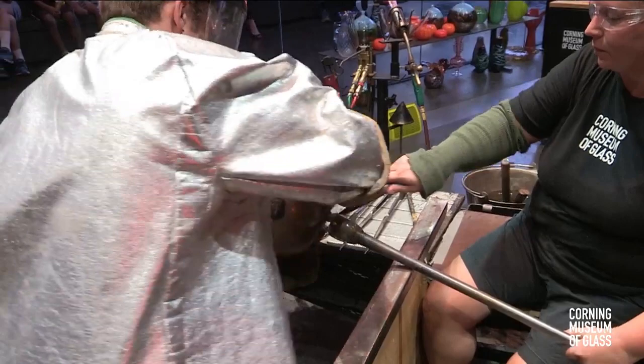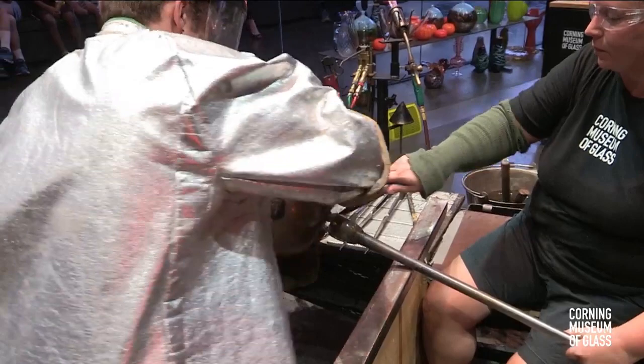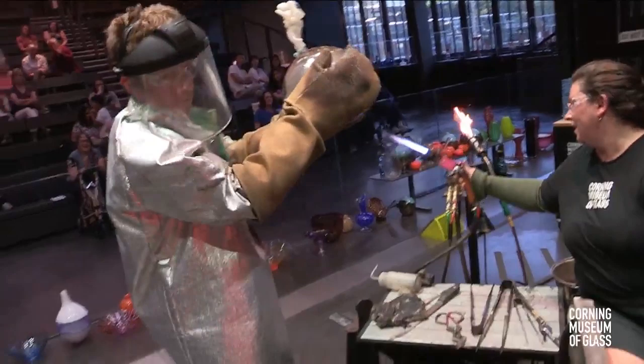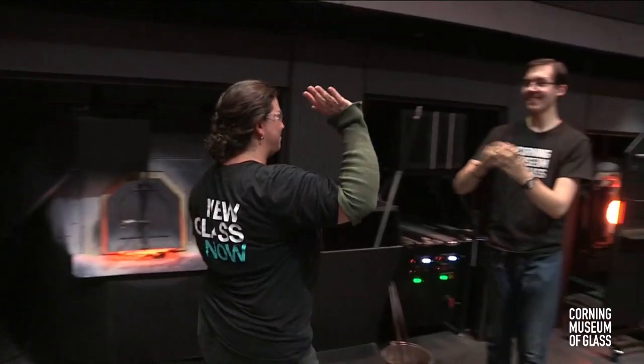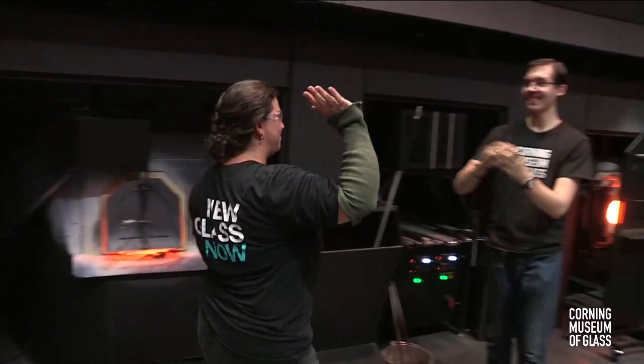Since that astronaut is all solid sculpted, we really want to cool the piece down very slowly. It's very important to equalize temperatures in the astronaut because we added all those parts at different times — all those connection points need to make sure they're nice and happy before we shock this glass by breaking it free of the punty. We've probably taken our final flash here. Just a little more heat with that torch onto the top of the astronaut. A few drops of water on that punty sight should shock the glass, and with a few light taps, the piece should break free. We'll fire polish that later so that it's not sharp. Into our annealing oven — we'll get to see this piece in a few days. Excellent, safe and sound. Catherine Ayers, everyone — and Chris Rochelle and Benjamin Ewing. Thank you!